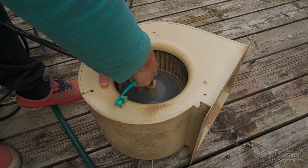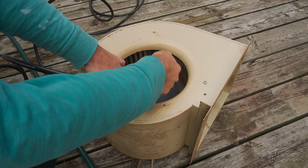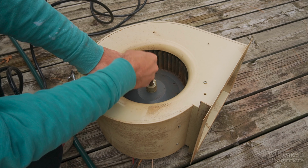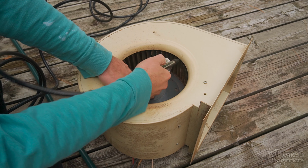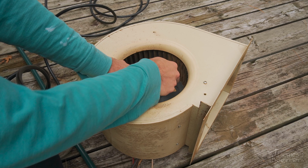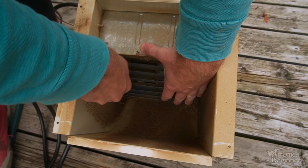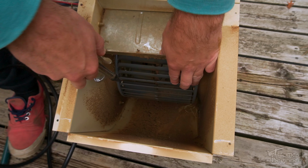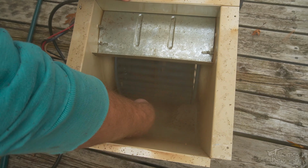As for the blower motor, it's best to take it outside as this can get quite messy. An air compressor can be used to clean a majority of the dust out. Typically it'll fall out. The blowing feature on a vacuum can also work if you have that feature. A low profile brush can be used on other areas, in this case a toothbrush for me. Make sure you clean all the fins on the fan. Moving the fan in another orientation, I can gain access to other sides of the fin. Then is cleaning the assembly around the fan, removing the dust stuck to the inside walls.